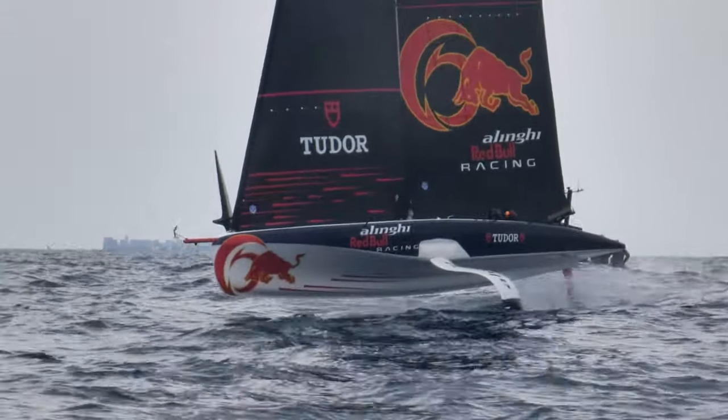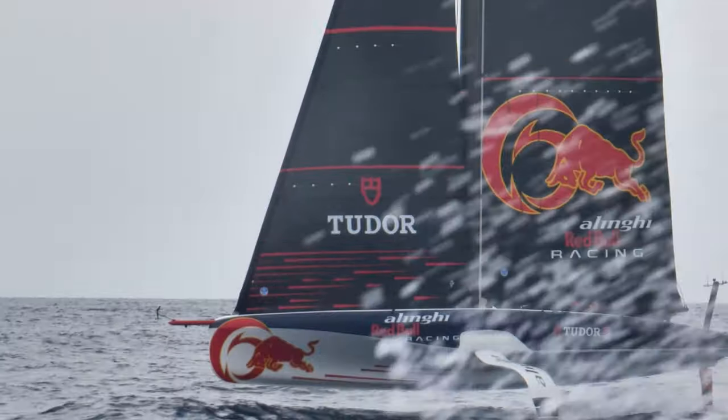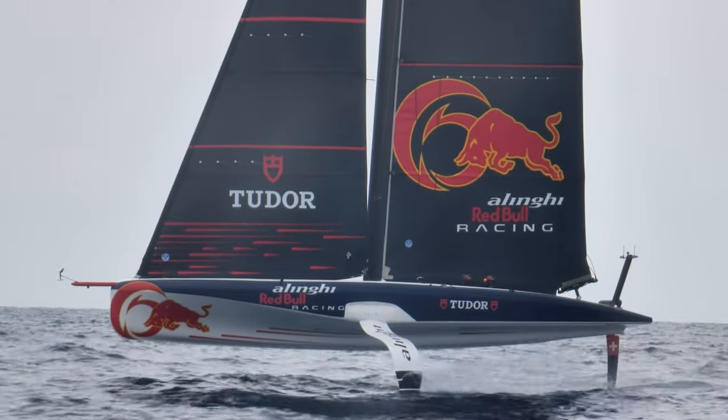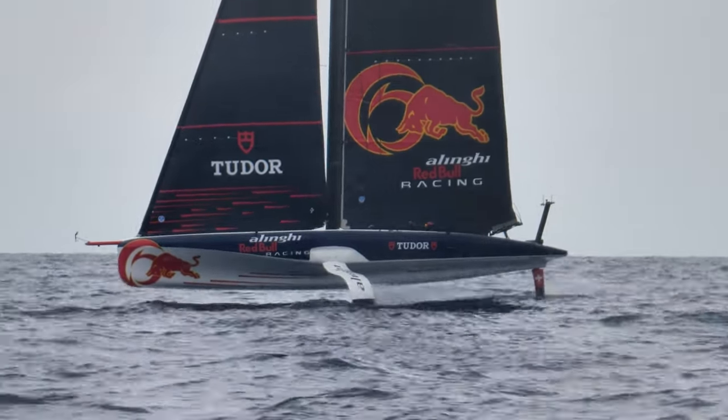Obviously, the outboard end is the end which is operating closer to the water surface. It's operating within that surface flow of wind-blown waves, where you have a motion of the particles in those waves. So that changes the angle of attack as you go through each wave, regardless of the foil tip breaking through the surface of the waves. The actual flow experienced by that foil isn't just the path that the foil's taking through the water, but it's actually the motion of the particles of water as they get picked up by the energy of the wave, which moves the water up and down effectively.